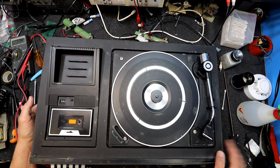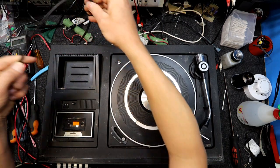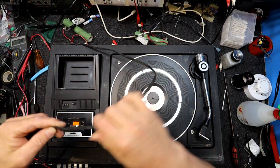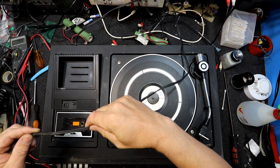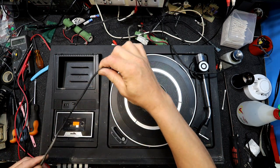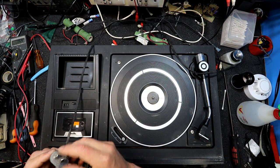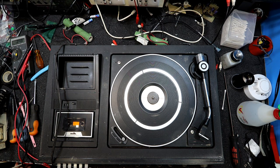Now I better check this mains cord again as the first bit of basic safety stuff, especially with these old figure 8 ones. These are known for getting damaged very easily. They're single, they've just got the one set of insulation, no outer sheath on them. Seems to be alright though. Oh, plug it in and see if it goes bang or not.